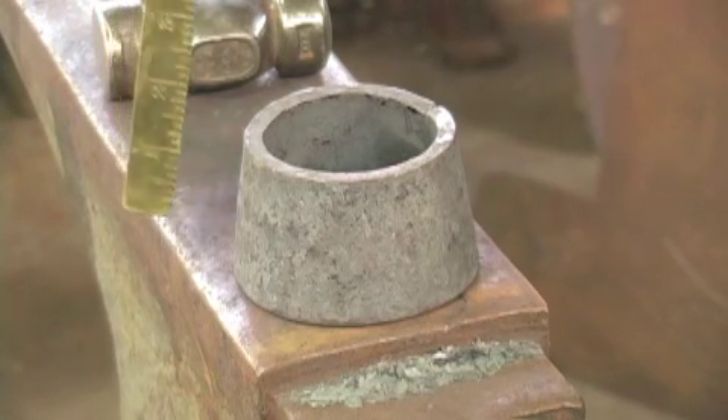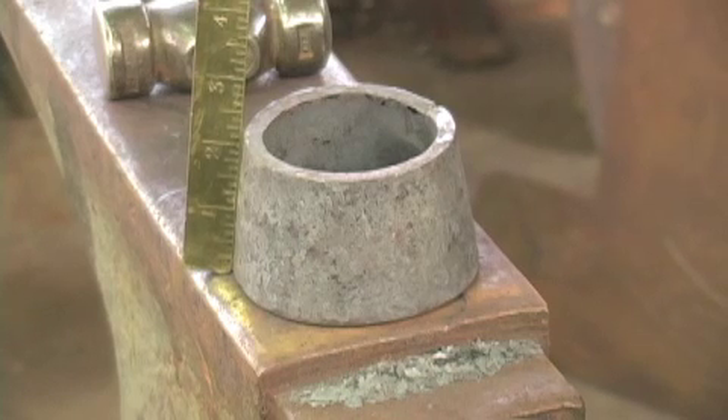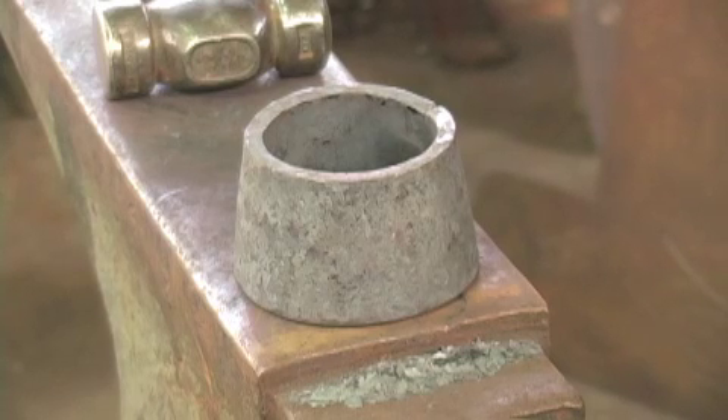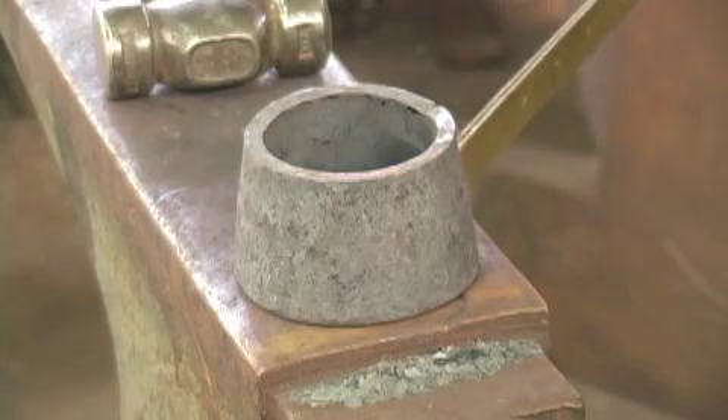Here's the frustum cone completed. I'm hoping the outside edges will be somewhat straight — that's why we dished in the swage block first, otherwise it would have been concave. At this stage I need this cone for truing up, and I need to actually split this and weld it to a plate, which is why I didn't weld the outside.